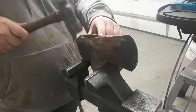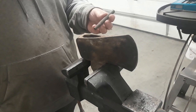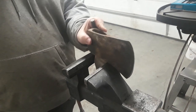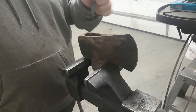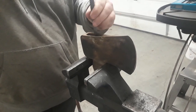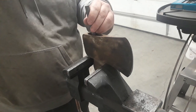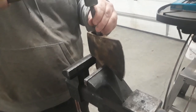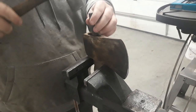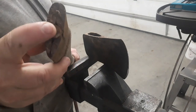The head's loose on here. What we can do is hammer this head back down and see if I can get that round wedge pulled out with a vice grip or a chisel. First, what I like to do is find a decent hammer and some kind of punch that fits in there and see if we can just drive the handle up through the bottom. I just have it sitting on the vise like this. Okay, it is moving — we're going to keep going and see if we can just get it out through the bottom. I think we got her. There we go — round wedge in there.